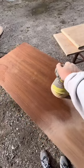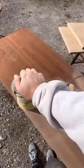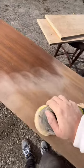I'm starting off with 100 grit and I'm being very careful because this piece is veneered. Then I'm going to incrementally work my way up from 100 to 220 grit. We have to make sure to sand down all of that putty so it's nice and flat.